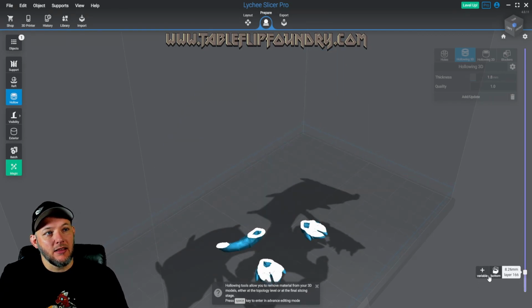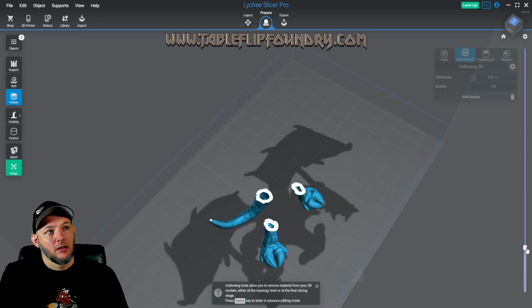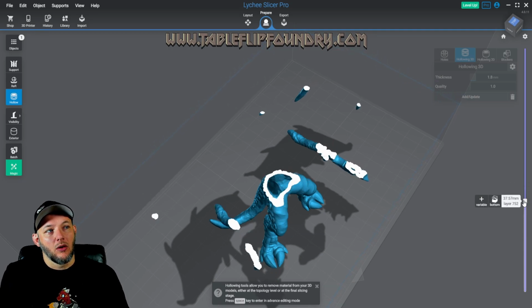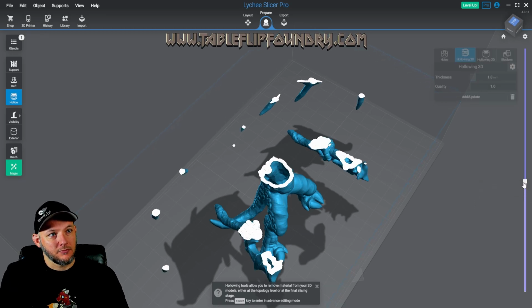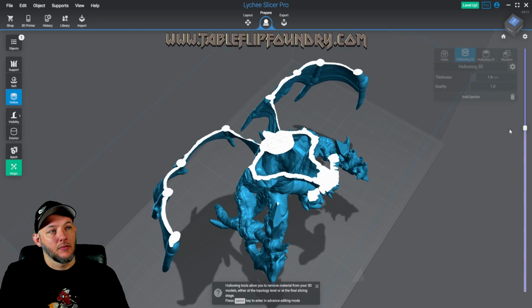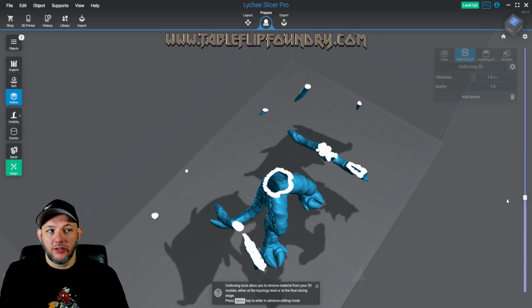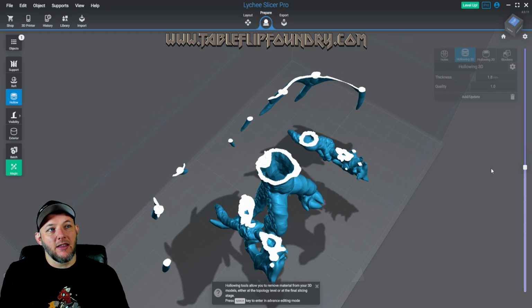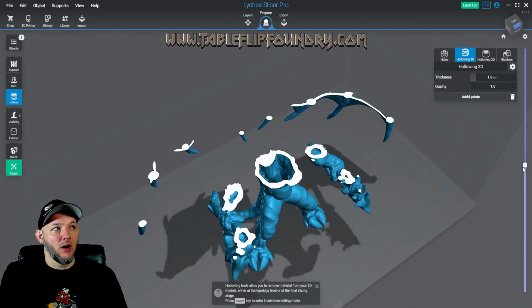So we can see that the feet and legs and tail start to hollow right away. And then that hollow goes all the way up into the body. We can see these axes right here start to hollow. And then the axes close, so we know that we can't put holes in the axes, or we don't want to, so we're going to choose not to hollow those. We can see that the arms start to get hollow way down low, but we know that we're not going to want to put holes in the arms, and so we don't want those arms hollow either.